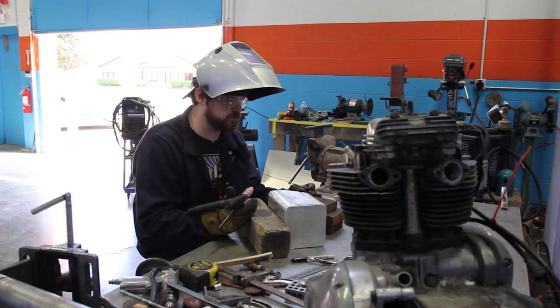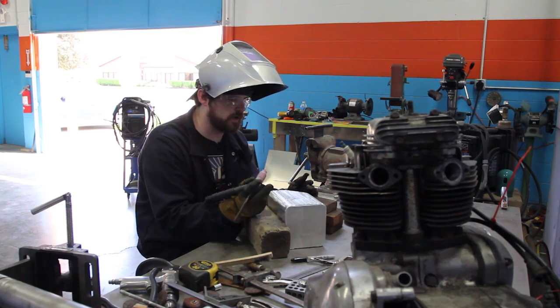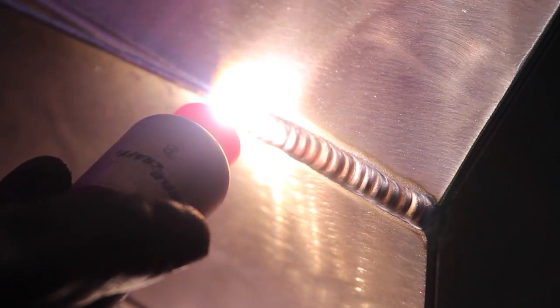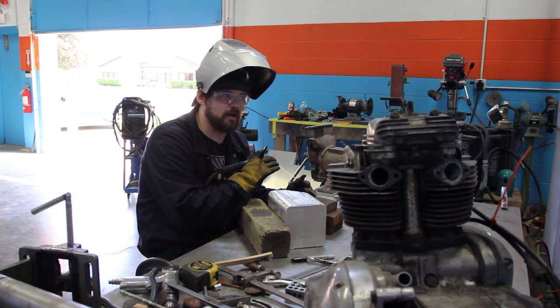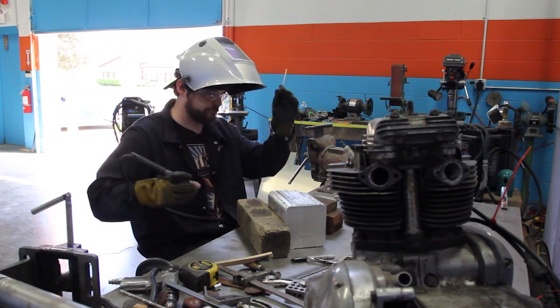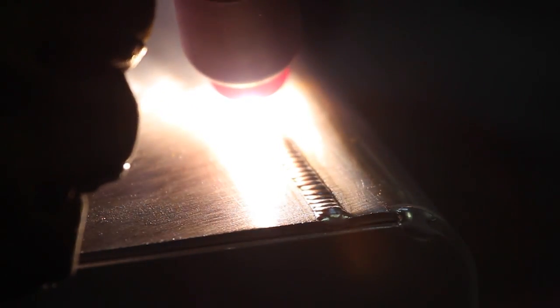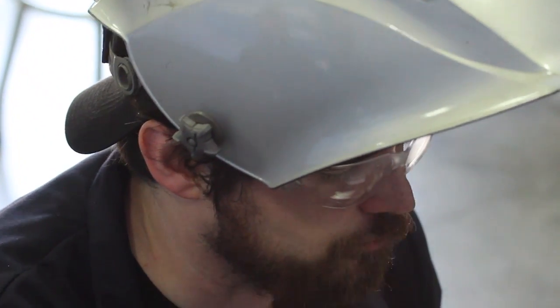What I'm doing here is I've got the butt joints — it's 0.1 aluminum, that's the thickness — so I've got them butted up tight together and all the edges are clean. I get the puddle started and then you're waiting for the puddle to kind of drop. It drops through and a little hole will open up at the leading edge of the puddle, and that's when you start adding your filler. When you do that, you get a nice even bead on the top and underneath will almost look like a flush joint — like it's connected — and it's a full penetrated weld, which is what you're really going for. I'm trying to move the piece around, doing three- to four-inch welds at a time, going from side to side, back and forth, up and down, trying to move the heat around so the piece doesn't move around too much.